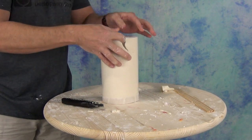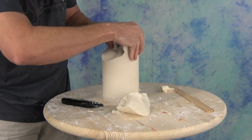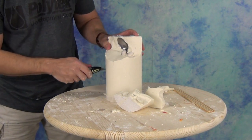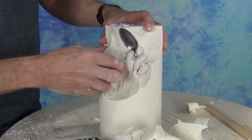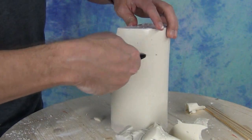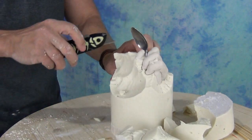For a hydrostone cast, we want to be real careful to pull away the alginate in a way that doesn't accidentally break our fingers. You'll notice I'm scoring it, being very careful not to go too deep with the razor knife into the alginate — just scoring it all around so I can pull it off in little chunks. Ideally a wood tool is even better. Since I'm doing a kid's hand, I know I've got a fair amount of depth of alginate. But if you're doing an adult hand and concerned about accidentally hitting the hand, use a wooden tool like a popsicle stick to check for the depth of where the hand is. Take your time with this step — if you rush it, that's a quick way to break off all those fingertips.